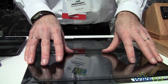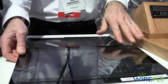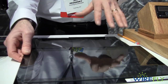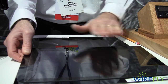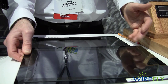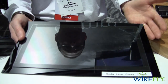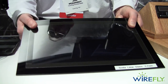Here's a mock-up of a display with a scratch put in the upper corner — these are 300 gram scratches, much lighter than the five newton scratches in the previous demo. We're simulating notebook handling: 300 grams represents a very light cleaning on your surface, and particles in a cleaning cloth could lead to scratches. This soda-lime sample with that scratch retains strength very poorly — I barely flexed this sample and it broke. That kind of flexure can happen very easily on notebooks on the market.